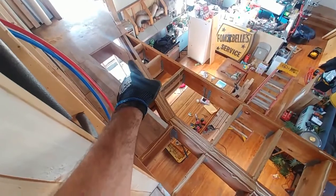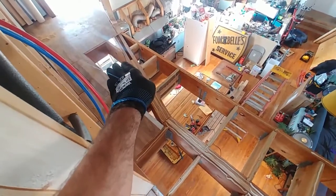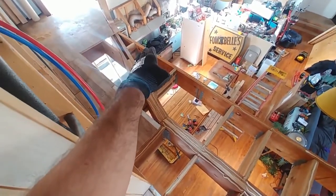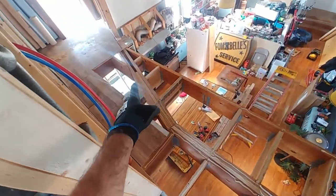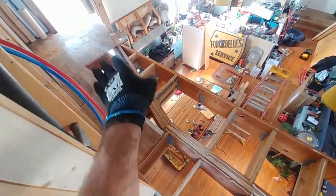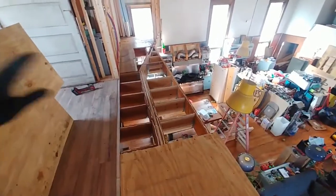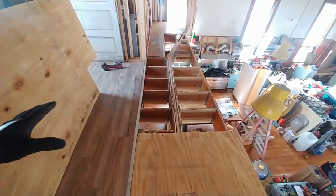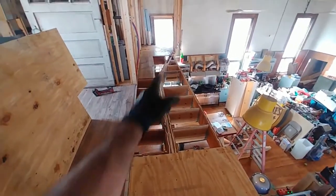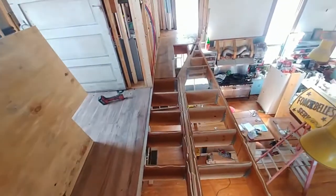You don't realize that when subfloor or any plywood spans 14 and a half inches across one floor bay, it seems like it should be able to do that anywhere. Well, normally it keeps going in both directions, or at least in one of the directions. You wouldn't come in here and put 16-inch strips down on 16-inch centers to cover this floor. It would be a lot bouncier, given the same thickness of material, than when you put bigger sheets down, because those sheets lace together, and you should be thinking about making one homogenized thing. And over there is not ideal for that purpose, but we had other reasons that we couldn't. I just keep pointing that out. It'll probably be fine. All right.